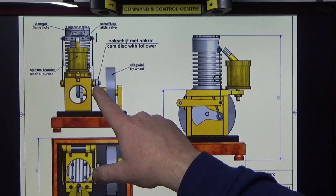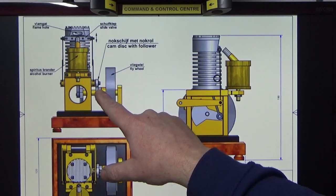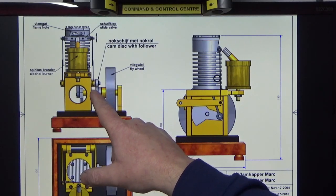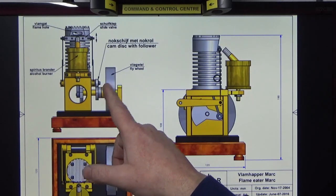There's the cam follower assembly, which also attaches to the right hand lever arm, and you can just see it there riding on top of the cam. So there's a little tiny stub shaft to make, and the actual cam follower itself, again, that calls for steel, so that's going to be steel on steel. I might be changing that out, don't know yet, I'll figure that out as we get to it.